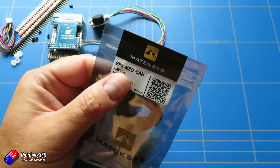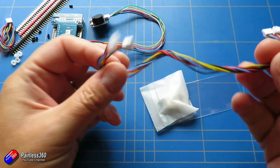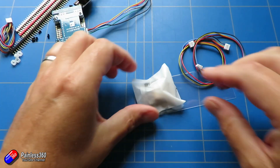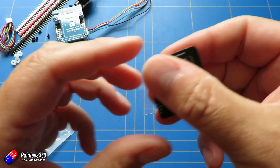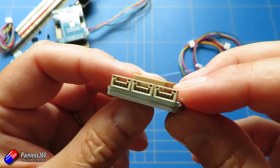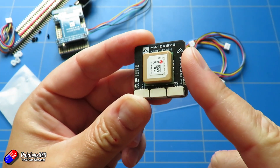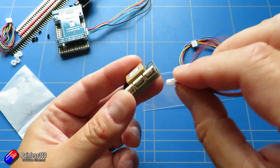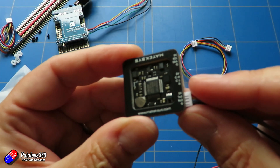Taking out its companion GPS - this is the M8Q CAN. Links below. You get a couple of cables, and these are the new CAN bus cables. Taking the little GPS out - I like the fact that it's not physically very big. This is a CAN bus connected GPS, one of the new features on this flight controller. CAN bus has been around in motor vehicles and auto electrics for a very long time - it's a really robust way of connecting things together. Some of the latest Pixhawk technologies have had CAN bus for a while. This little unit will connect to the flight controller using one of these special cables for the CAN bus - you have a power, a ground, and two data wires.